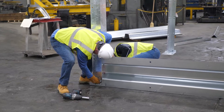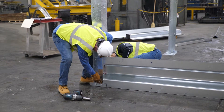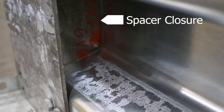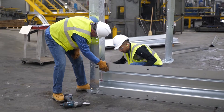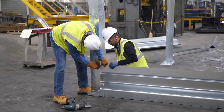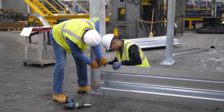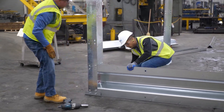Now that we have the vertical connector and grade plate assemblies together, we are connecting the bottom spacer. We later realize we should simultaneously include a spacer closure. Spacer closures are usually only at the front of the external transverse sections of the wall to prevent fill from escaping. However, with freestanding bin walls, they are used both at the front and back, but still only on the very ends of the wall — no need for these on internal transverse sections. You will later see where we go back and insert this piece.